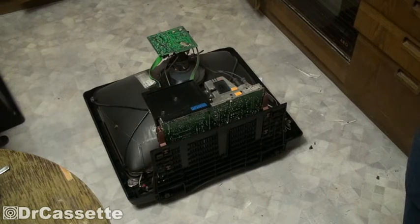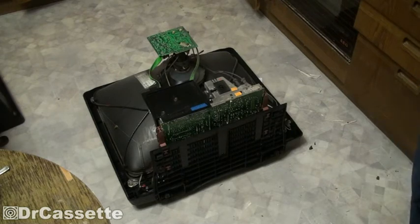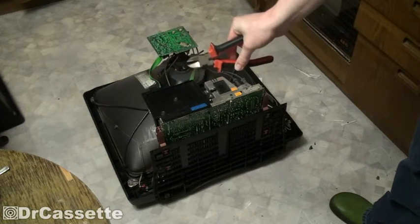With this one, I want to go a little further. I want to see if there are any more useful parts like on that circuit board. So, by the way, no stupid comments about my shoes — these are garden shoes, they are green and I don't think that's anything anybody could laugh about. It is safe to mess around with this. As I said, it has not been turned on, has not been plugged in for almost a year. So all the capacitors should be discharged pretty well. And since the picture tube can charge up, and I think the flyback transformer can charge up in some way too, the first thing I want to do — I hope these wire cutters are just as insulated as they look.